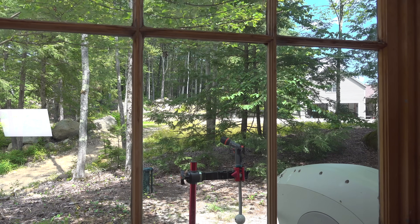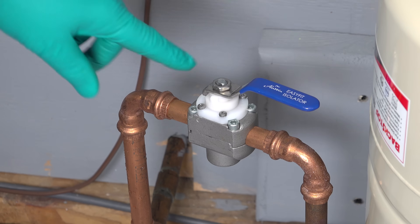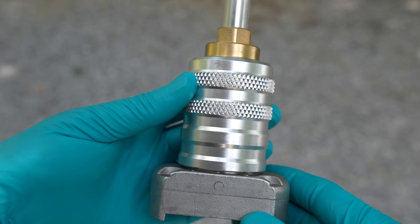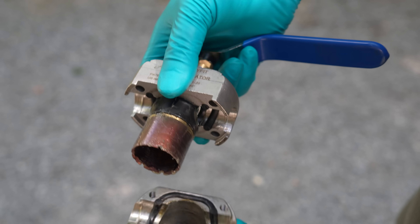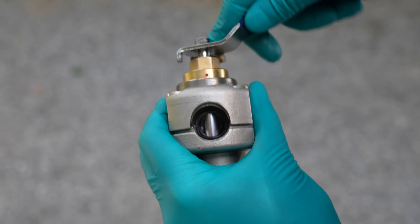So that was a live line with a valve installed — that is amazing. Now you're probably wondering what did that valve actually do to interrupt the flow of water. Contained inside this collar is an integrated pipe cutter. The cutter goes through your copper pipe and pushes the pieces it cuts into the bottom of the valve. When I press the stem down, I'm actually moving the ball valve into the flow of water, and then I can turn the valve body so that ball valve inside the housing can interrupt the flow immediately.